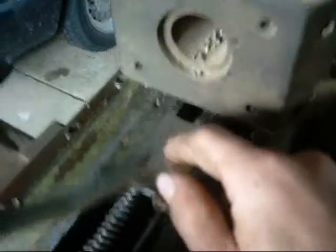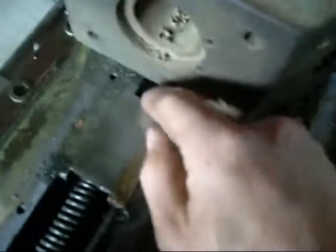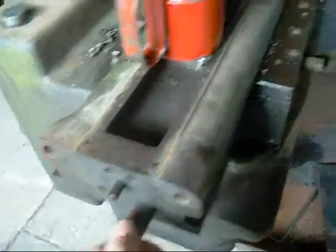That's the mechanism that locks the turret into position. When the turret's retracted all the way, this is supposed to trip a little lever down there — it's supposed to push it back and disengage. And then this thing here is supposed to be operated and fling the turret around to the next position. But that's not happening.